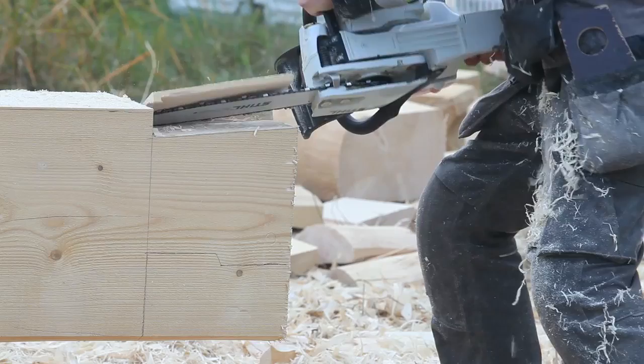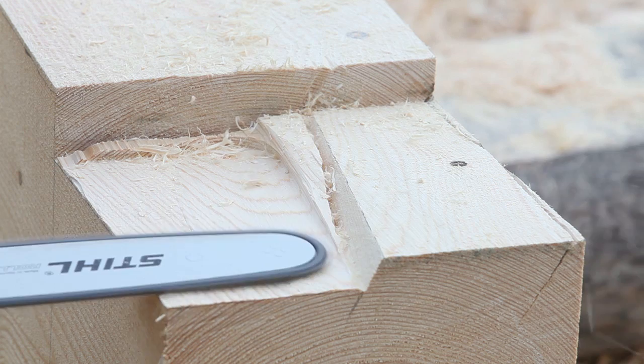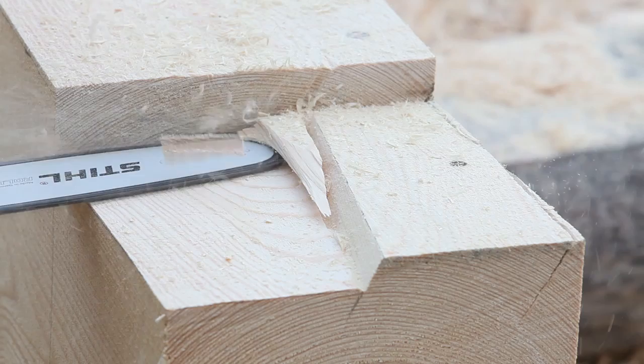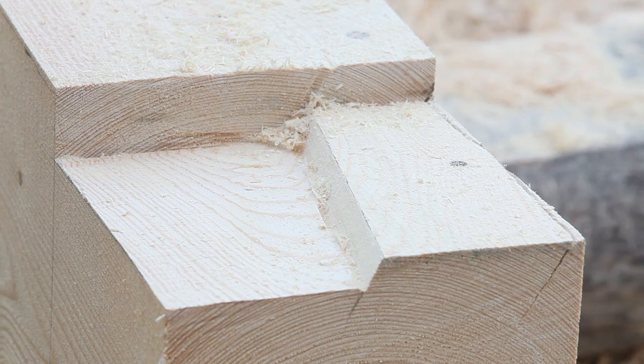The shrinkage of diametric fibers with respect to longitudinal fibers results in loosening of the vertical joint after the terminal drying. In this notch, the wedge-shaped tooth slides the upper log diagonally against the crossing log.